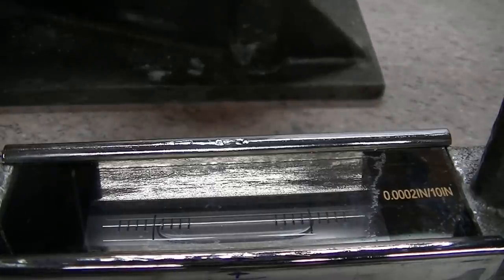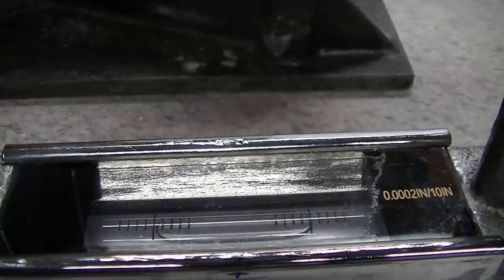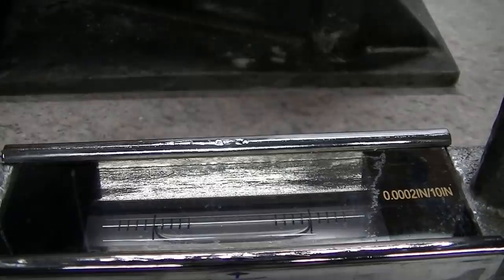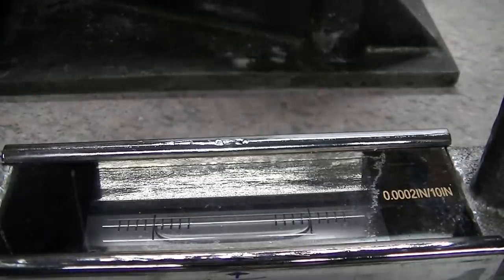You can see it working its way in. This bubble actually responds pretty fast — it seems snappier than what I'm used to with the Starrett. Just a tad more, a little nudge. I'm still roughing here so I don't have to be dead nuts, but I'd like to be, so I don't have to interpolate and remember how much my zero was off.